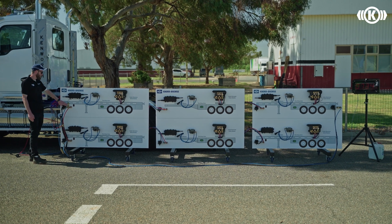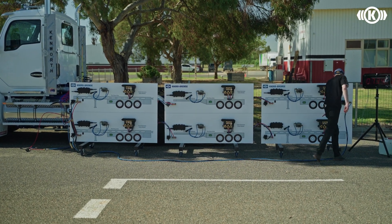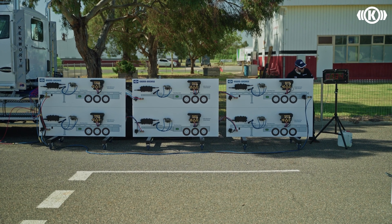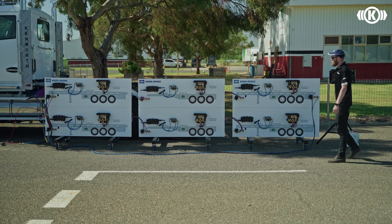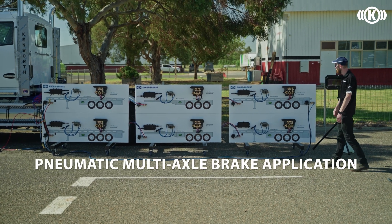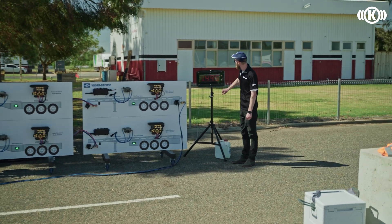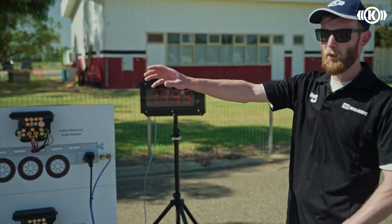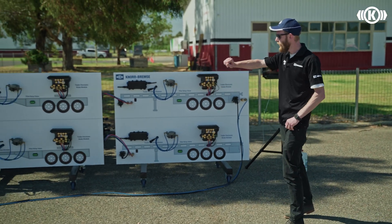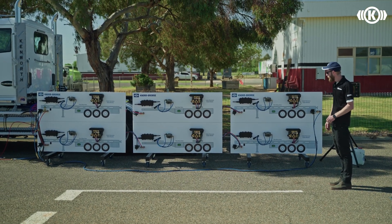In this setup we want to measure the time difference from a service brake signal at the front coupling all the way down to the last — sixth — trailer in the combination. We've changed over the pressure switches to get that timing signal and reset the board. Applying the brakes: we've got 1.495 seconds taken from an application pressure at the front coupling to reach and have an output down at the last trailer. One thing to focus on is how those applications were carried out — did they all simultaneously come on together or was there a delay and lag in these axle groups applying the brakes?